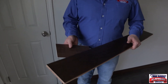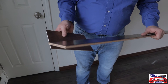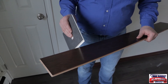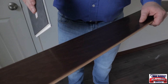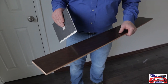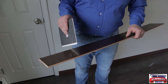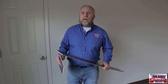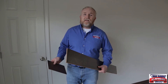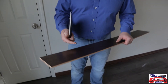Here are some different flooring options. I don't have laminate to show, but here's engineered floor. I'd normally only use engineered in a higher-end rental, unless you find a closeout — then it works great at all rental grades. The unit also needs some humidity; it can't be super dry or you'll have issues. If you can get engineered floor under four dollars a square foot, or even under three dollars on closeout, it's not a bad idea.